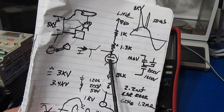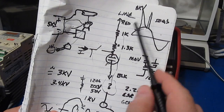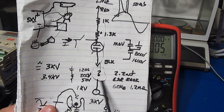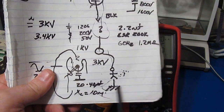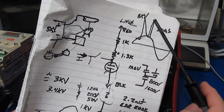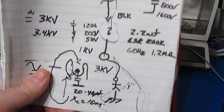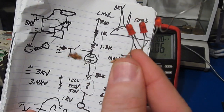So if we're putting 3,000 volts across this whole circuit, 1,600 of that is going to be across these two MOVs. The GDT is a little different — once this thing fires, the voltage drop across it is going to be essentially 0 volts. So now that 3,000 volts we're applying is going to be dropped across these two resistors, this unknown network, and then our device out here — which in this case would be a human attached to ground. But as you saw in my previous video, applying even a 5,000-volt transient through this meter, I didn't get enough energy to even damage our three LEDs and our 1K ohm resistor.